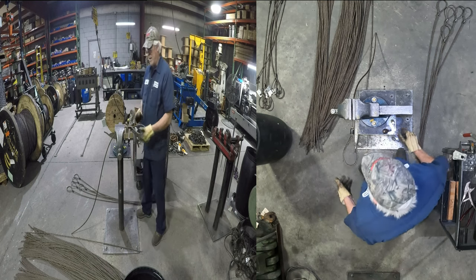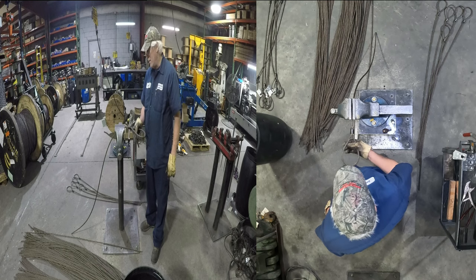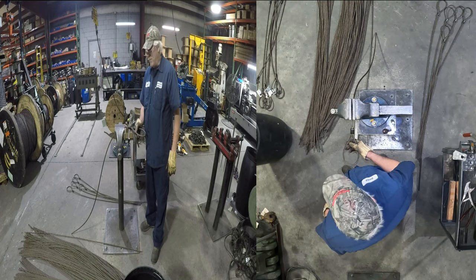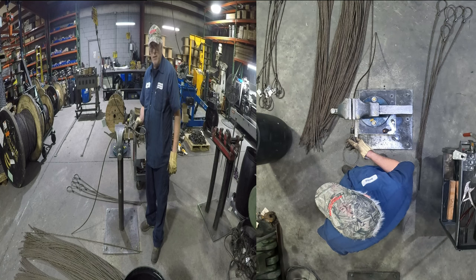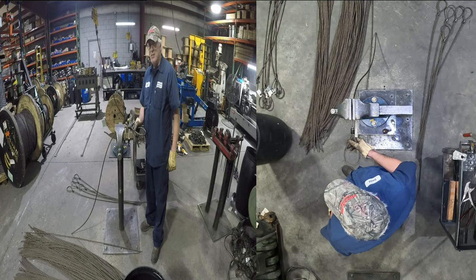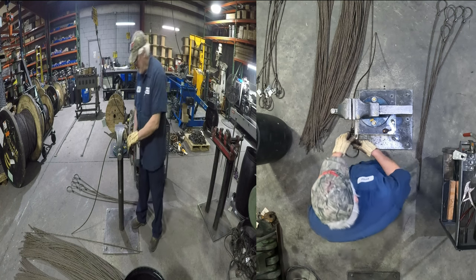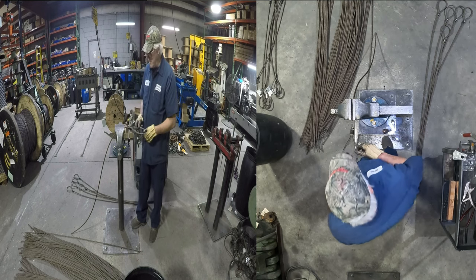Now, with that being said, I had a guy make a comment on one of my other videos on 1¾ inch. He said, that guy there with the flashlight looking in that sleeve to see if the tails are up, I wouldn't buy a sling from a company like that if he's looking inside that sleeve with a flashlight to see if his sleeve is up on the tails all the way. And I thought to myself, I would rather make sure the sleeve is all the way up, because sometimes that wire can catch and dig into the sleeve inside there and not go all the way up. Well, you look in there and you can see the tails at the taper. It's where it's supposed to be.